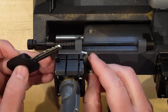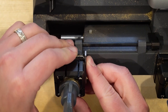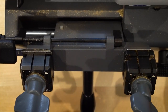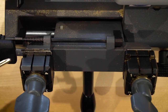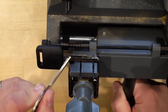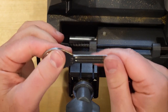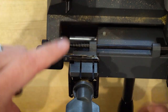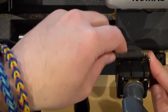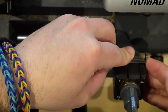What I like to do is use the same bar and just hold it at the end. So I'm going to put the key in just like this — hold it up there, make sure you have everything centered and aligned and straight, and then just put it in just like that. By doing this, you're gripping on the key from right here on the blade — all of this good meat right here — and we also have just a little grip on the other side. That's going to allow the key to not flip out of the jaw when duplicating. Get the tip stop in there and we're good to go. Get that tightened down and let's duplicate.